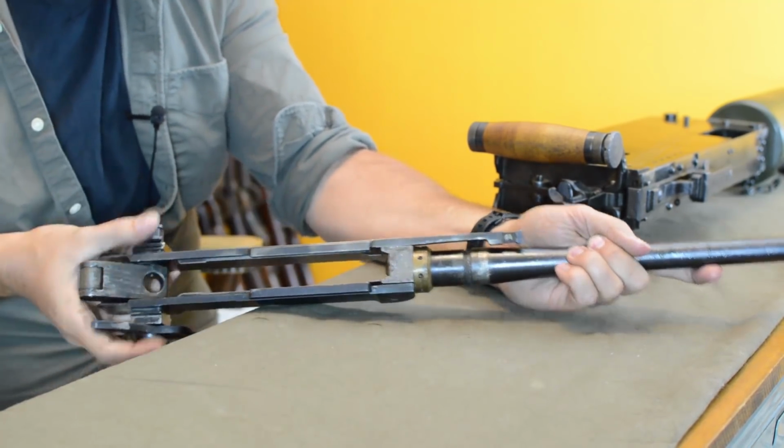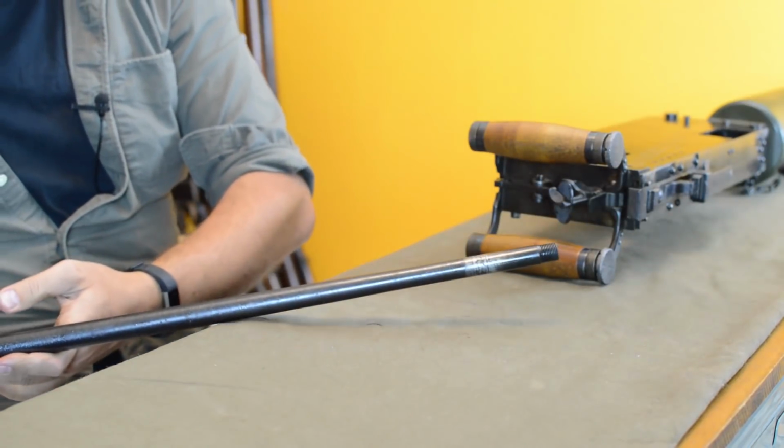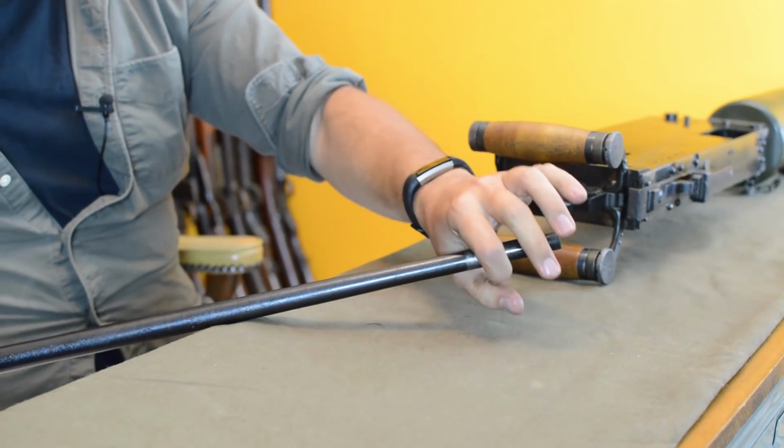And then at the front, you notice there's no relief because the washer is being carried by being pressed between the muzzle booster and the jacket. That's also a big asbestos ring. Those are no longer available, so you're gonna see ours drip a little bit. Anyway, more on that in a moment. But basically, the way that's set up, I can pull the barrel out, I can check this rear seal, and the front seal remains mostly intact because it's being held by the booster and the water jacket.